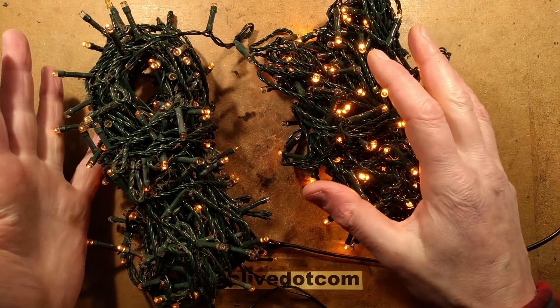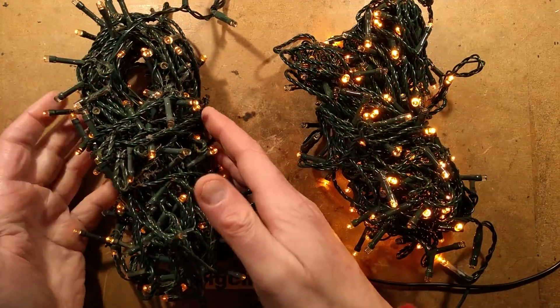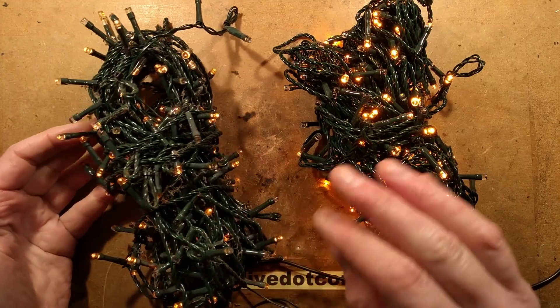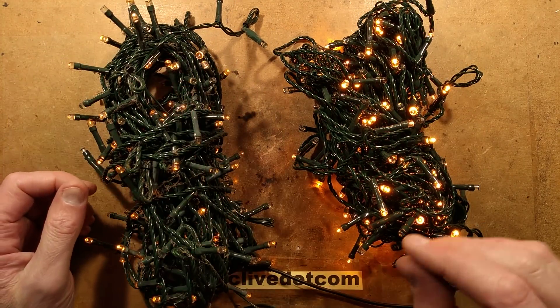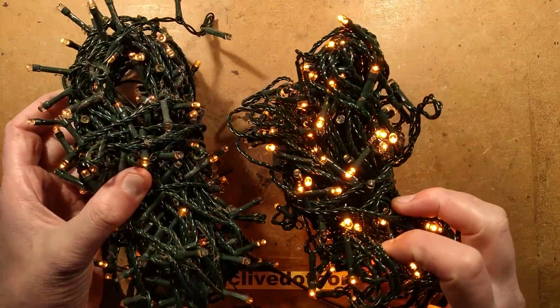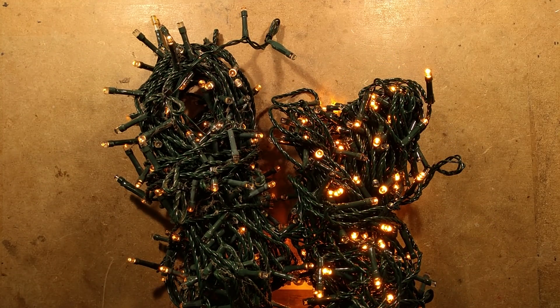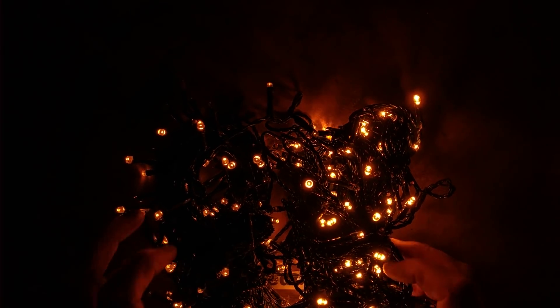It's a tenth of the brightness drawing the same amount of power. It suggests it does make sense every so often to treat LEDs as a consumable item — just ditch them, scrap them, and replace them with new sets. Because for the same power you're going to end up with a much sharper, brighter display. So there you go — LED degradation.